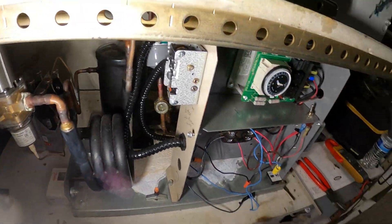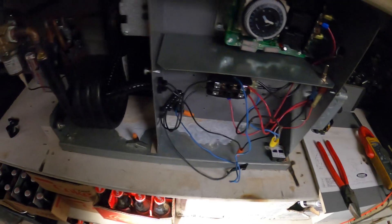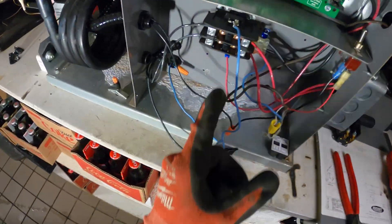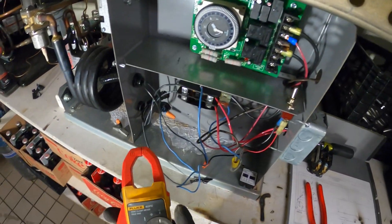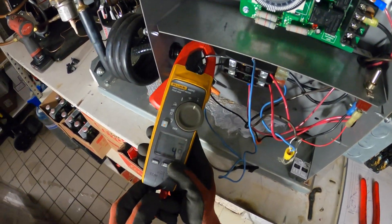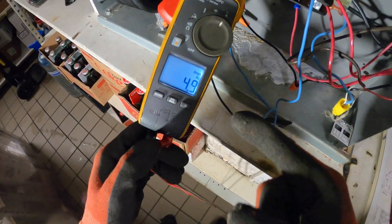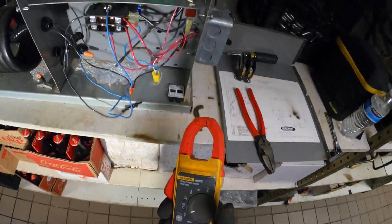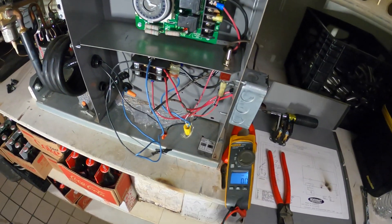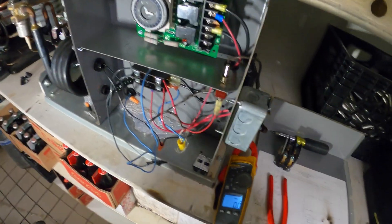Compressor started, man — that's what I'm talking about. We still don't have a light here though. Contactor pulled in. Here are the compressor wires — we've got 4.9 amps. That's a beautiful thing. So it wasn't the contactor; that was so weird. That gave us a weird feedback — I had 120 on each side but it wasn't true.